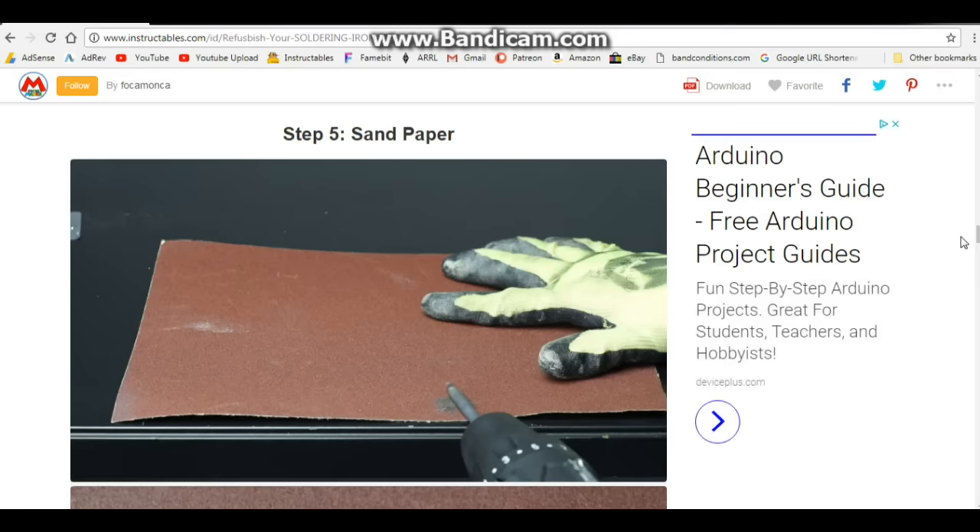Great balls of fire — you won't have any soldering iron tip left. You're gonna take the coating off of it and you're going to be left with nothing but the core metal, which is going to pit and oxidize and eat itself up like the snake that eats itself. Let's go over to the bench and I'll show you how to clean and re-tin your soldering iron tip.